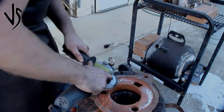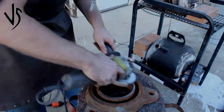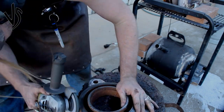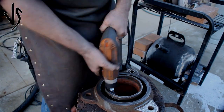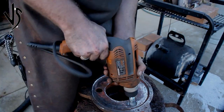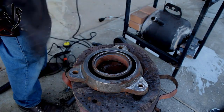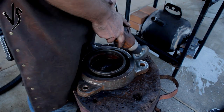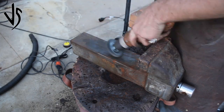This piece especially you want as smooth as possible. This is the mounting plate where you're going to be putting the tool on, and that rest where it slides around. I want that groove on the inside, that lip on the top, all of that super clean so I get a nice smooth action. Everywhere else can be rusty and crappy, but that right there you definitely want clean. So I spent way more time on that part than any other part on this entire build.